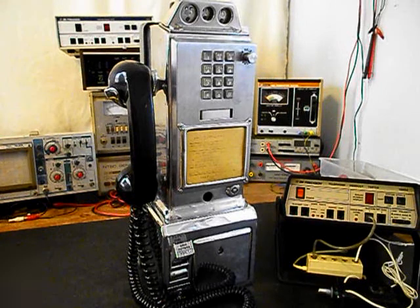Now, this payphone has a hardwired line cord installed just hanging out of the back of the payphone. And we're going to go ahead and get rid of that line cord and install a modular port so that you can simply bring in any length line cord, any color that you choose. Plug right into the modular line port, makes for a simple, easy plug-and-play connection.